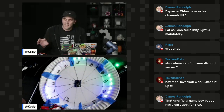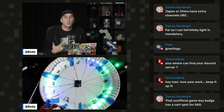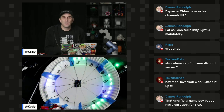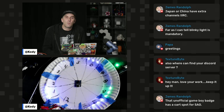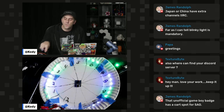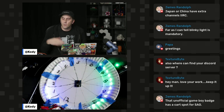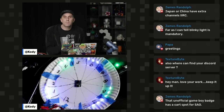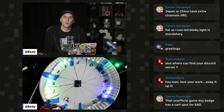What's also cool about this design is it separates the LED pulses into colors, and each color means something different. A blue one is a beacon frame — basically an access point advertising itself. If there were a bunch of access points clustered on a particular channel, we'd see them constantly beaconing. We can see channel six has a ton of traffic, and a lot of those are blue beacon frames. The green ones are devices basically calling out for a network — things like laptops, cell phones, making requests for an access point to join.